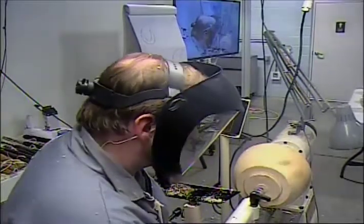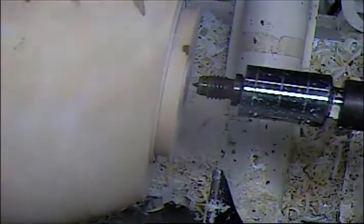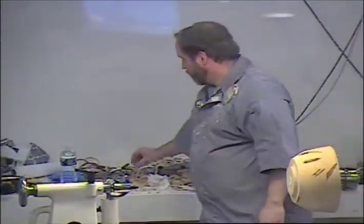And I can see without that tailstock in there, it's kind of wobbling around a little bit. Okay. But before I take this out, I want to make sure that I put that live center back in, because I want that dimple in the end. And we'll talk about that later. Okay, so if there are no more questions about this part, then we can go ahead and get this flipped. I don't want to use my dinky little 2-inch chuck for a bowl of this size. I definitely want to go bigger.